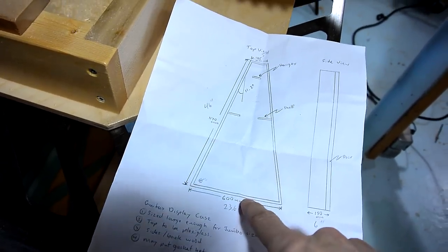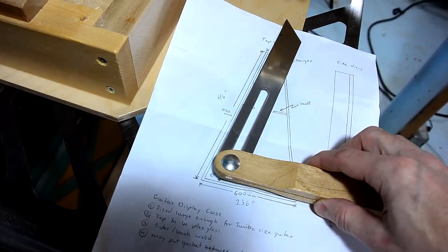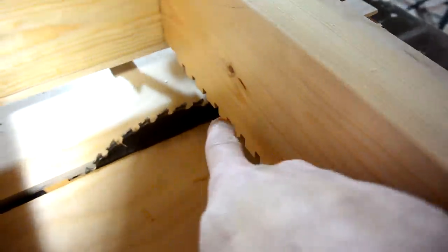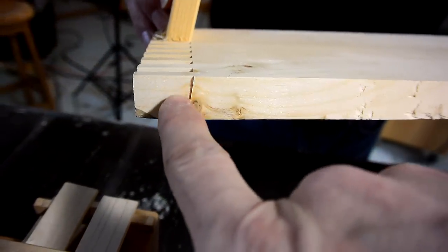This is the guitar case shape that Pat wants to build. I worked out the angle and set this bevel gauge to it, and we cut the miters by basically not running the jig all the way across the blade, so that there's actually a bit of an angle at the top of the thing. That leaves a little bit of an angle here, although it's curved.